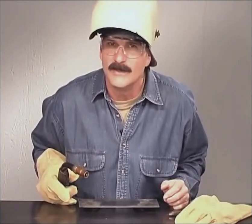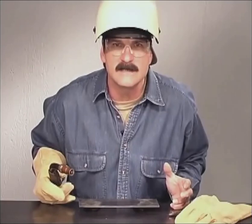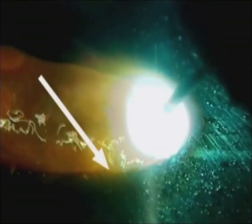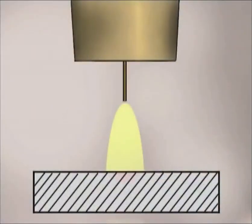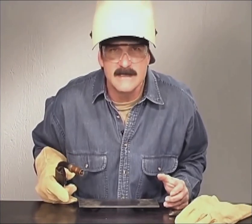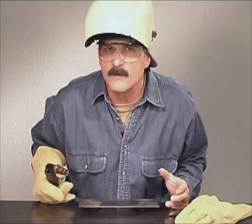The speed of travel — how fast you move the gun — depends on how much heat is at the weld. You do need to move right along without hesitation to avoid excessive weld buildup, but you also have to give the arc enough time to melt the base metal, allowing the filler metal to flow out and tie in on the sides. To some extent, you can see this by watching the edge of the molten puddle. If the travel speed is too fast, the metal doesn't have time to heat up and the weld bead will just stack up on top without fusing to the base metal. Traveling too slow will generally put the wire and arc on the weld buildup, causing excessive filler metal deposit and reducing the amount of heat to the base metal. Travel speed is the main option used during the weld to control the size of the weld and ensure good weld fusion.